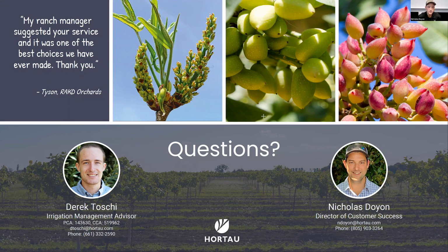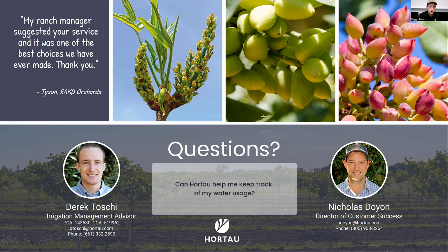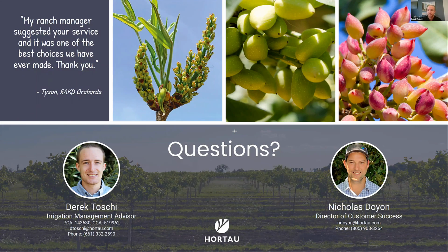Can Hortau help me keep track of my water usage? Yes, so each Hortau station is equipped with a pressure transducer, which can measure the total irrigation hours throughout the season. And if you're willing to send us your application rates, we can build a water report that can show you how much water you use during the season.